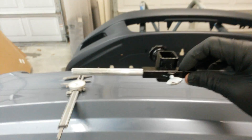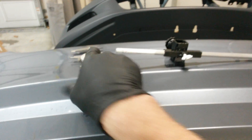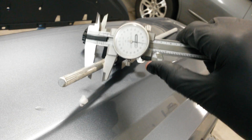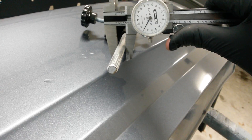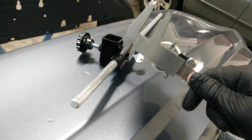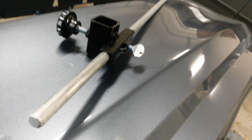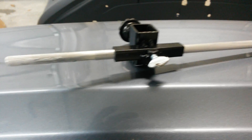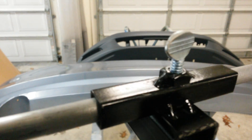On the other side, as a pointer I just used a round piece of aluminum stock, three-eighths inch diameter. I found a piece of square tubing that it would slide into pretty easily — it's actually kind of a tight fit; I probably should have gone a little bigger. Essentially the same thing: drill a hole through it and weld a nut.